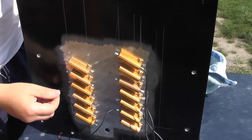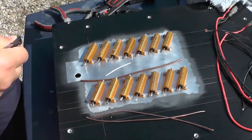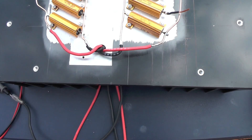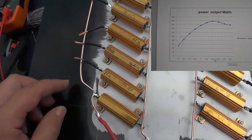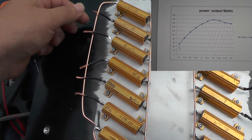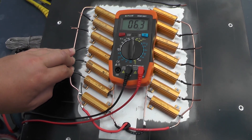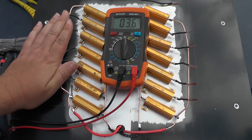By the way, I was preparing this video from summer, so these clips are from summer. Now it's winter, so I'll continue testing in winter — in summer I got about 160 watts as you'll see. I left this wire here so I can connect and disconnect resistors, and I want to measure the MPPT — maximum power point — of the solar panel during winter. Right now I have 12.6 ohms, and connecting more: 8.5, 6, 5, 4, and 3.7 with all of them.